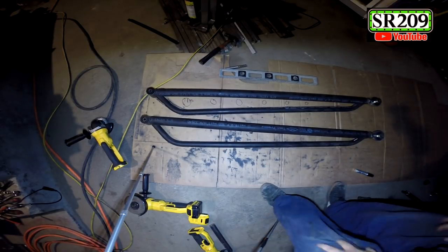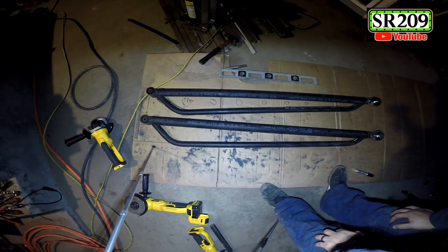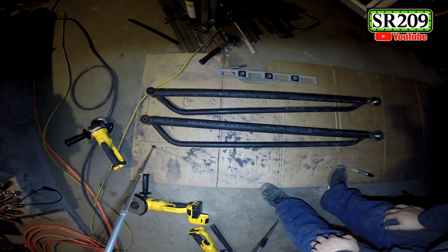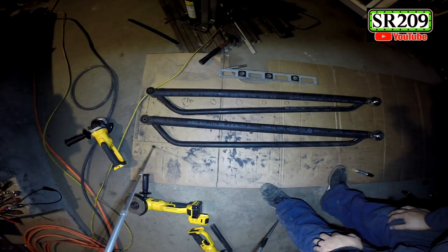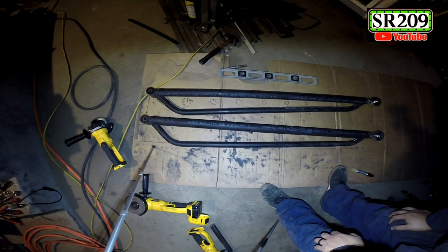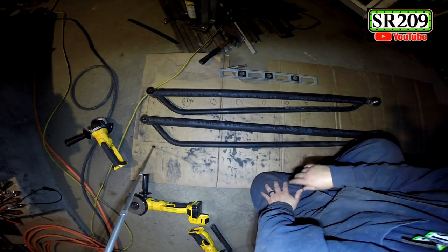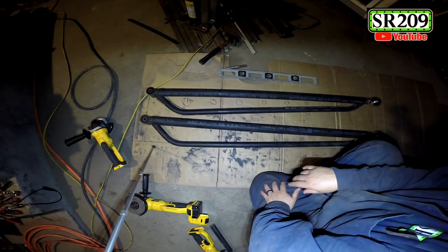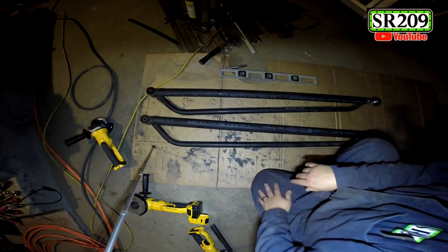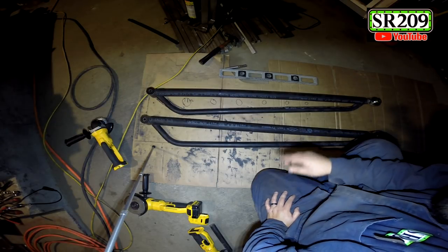After some grinding with the cutting wheel I got both pieces cut up. They're off by about an eighth of an inch but I'm good with that — these are mainly just for looks anyway. Now I'm just going to weld them in place, and then I'll proceed to cutting the sheet metal that goes inside there. I'm thinking of just putting a piece through the center — I'll think about that and tack these up real quick.